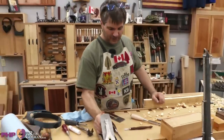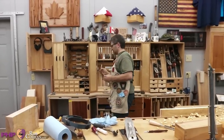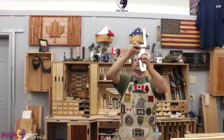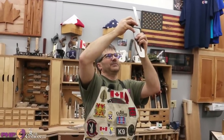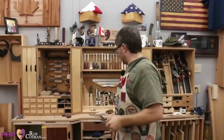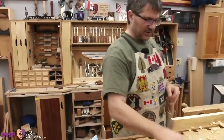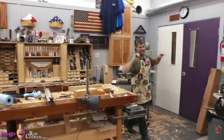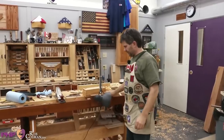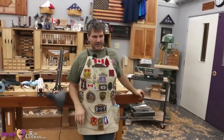And if that proved to be not the issue, then take your blade and carefully, I don't like doing this to the edge of a blade, hold it up to the light. What'll happen oftentimes is you'll see light in the middle. Well, if you see light in the middle, then you don't have a straight edge. I almost started answering a different question, but you got to be able to see just a little bit of light out in those outside corners to know you've got it perfect. And I'm surprised how people pick up on it really quickly, so it doesn't take long. But check the lateral adjustment. That's almost always your biggest problem.